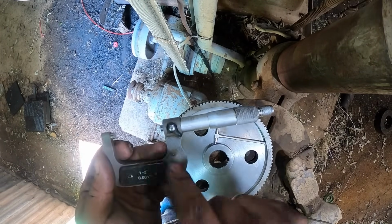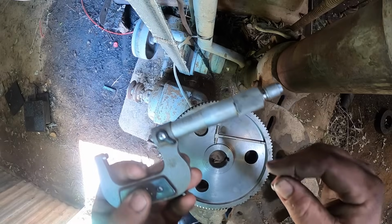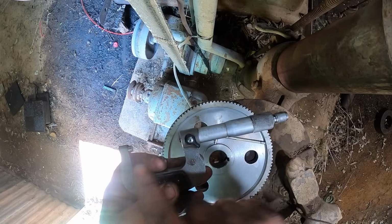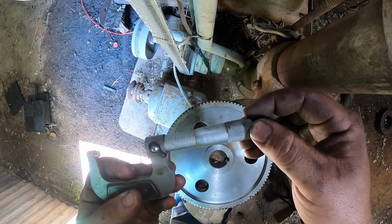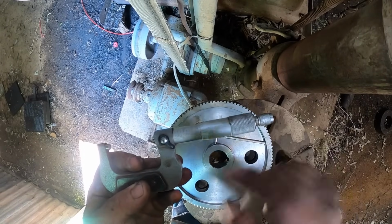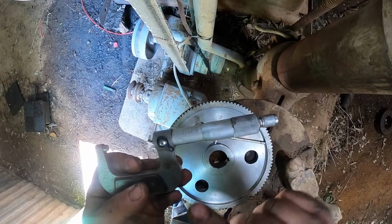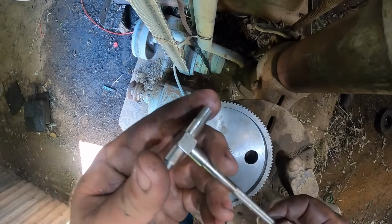This is a 1 to 2 inch mic. This is a Chinesium, probably Pittsburgh Harbor Freight. Nothing special, but it has an accuracy of within about a 1/2,000th of an inch. So this is 1 inch plus 975. Each revolution is 25 thousandths. That would be 1.9 inches, 1.95, 1.975.